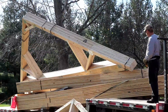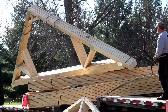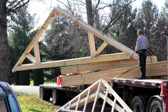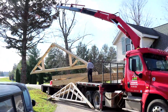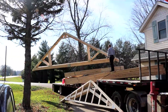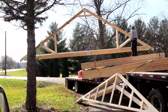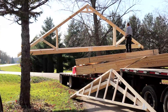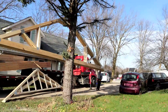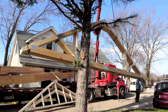This is an engineered truss designed for an attic, so my garage is going to have an upstairs. If you look at the top middle part, the very middle is over six feet tall, which is great because I'm six feet tall — I'll be able to stand up there. The clear space side to side is about 14 feet. The bottom board on these trusses is a two-by-ten, making them pretty big pieces of wood. Each one weighs over 200 pounds, so it's going to be interesting when we actually put these up.